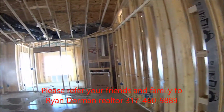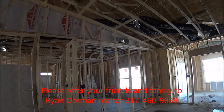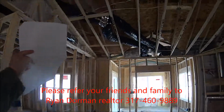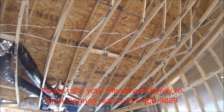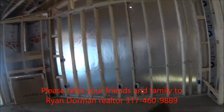As you come around here into your great room, you will have 3 switches over here on this wall. 2 of them are for your ceiling fan pre-wire. So one would operate the light, one would operate the fan. The other one is for your half-hot outlet, which is that outlet over there in the corner.